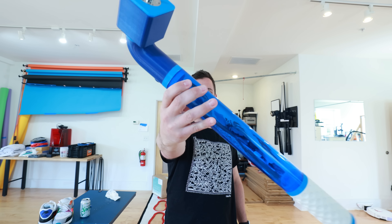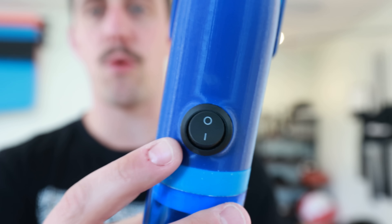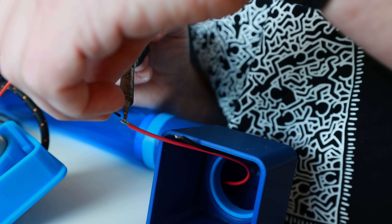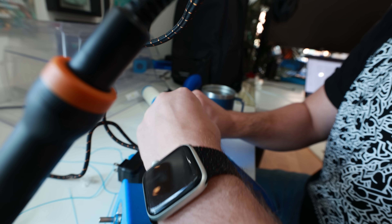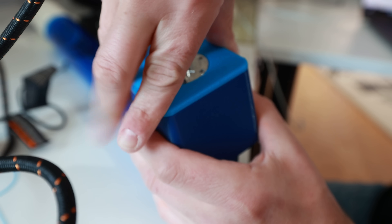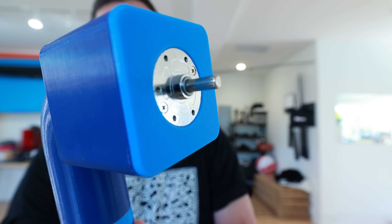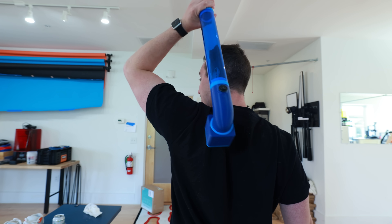This thing is looking beautiful. On the bottom half we have the handle with that grip texture — it came out looking so smooth. It attaches to the acrylic tube that goes up to the top section, where I already installed the electronics. I just had to do a little bit of soldering to connect all the pieces together: one side of the battery attached to the motor, then from there I attached the other end to the button, and finally completed the circuit by attaching the button to the other side of the motor. So when I push the button the motor spins around, and I could slide that right into place.